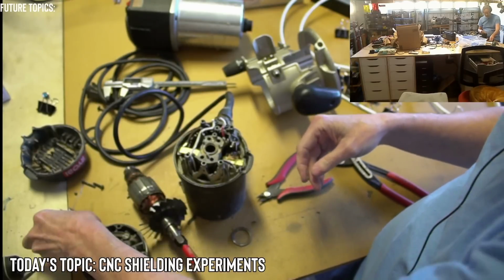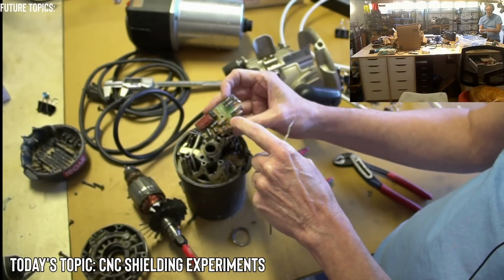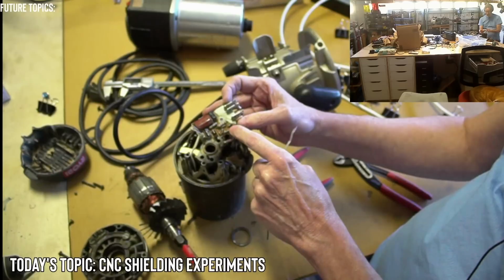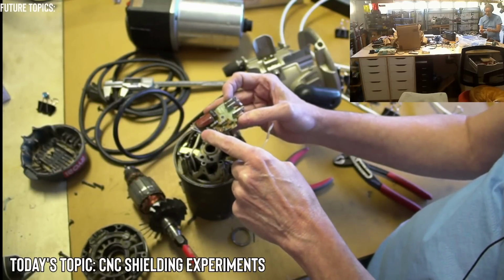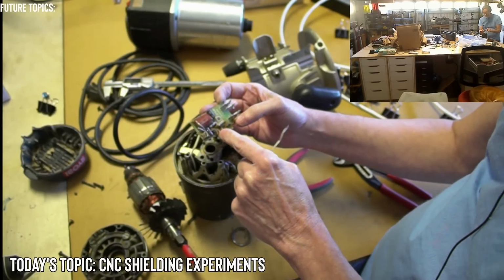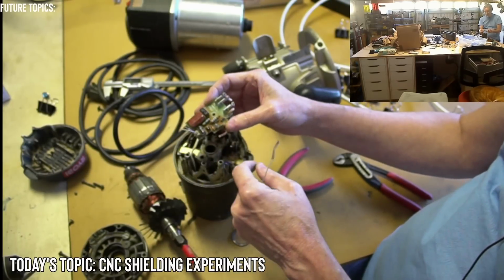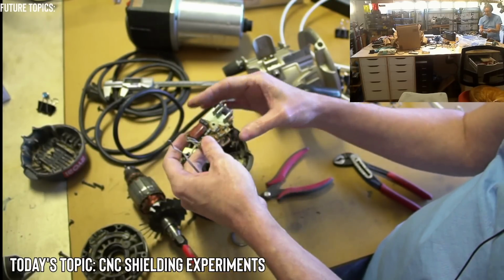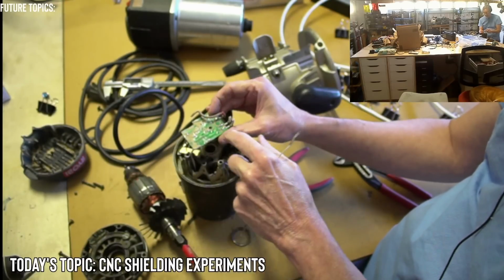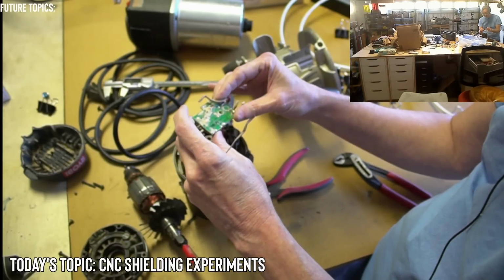Oh, look at that. Wait, where was? Oh yeah, this was right here, wasn't it? Oh wait, this stuff was probably only for the LEDs. So the rectifier was probably just giving the DC output for the LEDs, and this probably brought the voltage down. Maybe the transistor probably helped that as well. It'd be interesting to look at that circuit, but pretty simple circuit for just putting on an LED, and then the rest of the output probably just went straight to the motor. So it is probably an AC motor. You can see just these went straight out to this inductor, it looks like.